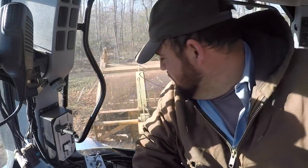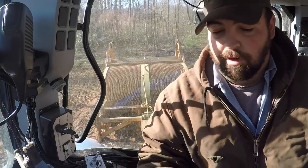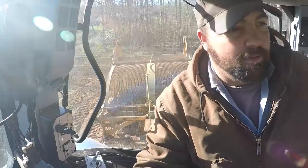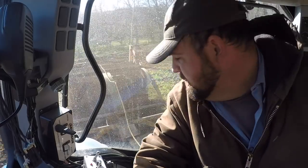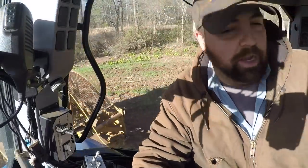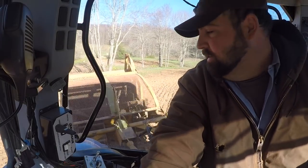Stuff out here to get up. And what you're supposed to do before running this machine is there's a rake that goes with this machine that you go around with and rake the rocks into windrows. Well, that rake doesn't work the best in the world. It takes forever to get your rocks raked up. So what I'm doing is just going around and hitting the big rocks that I see. I ain't real worried about the smaller rocks. I'm just trying to get up the rocks that are sticking out like a sore thumb,